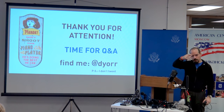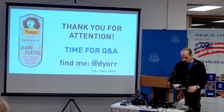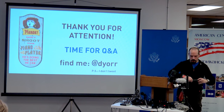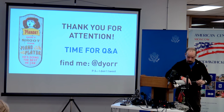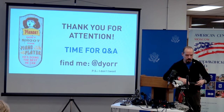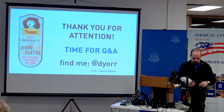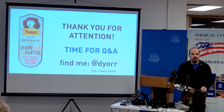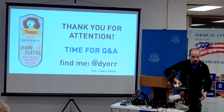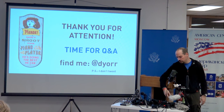So basically what I didn't say earlier, dynamic microphones do not require power. Condenser microphones do require power. Either they are powered off a built-in battery that lasts reasonably long. This one is maybe 4 months old, and that's a crappy alkaline battery, and it still works. And I often forget to switch this microphone off. So either microphones are battery powered or they require phantom power. Frankly speaking, I don't remember why phantom power is called like that. I know it's just a plus 9 to plus 52 volts range, mostly plus 48 volts.